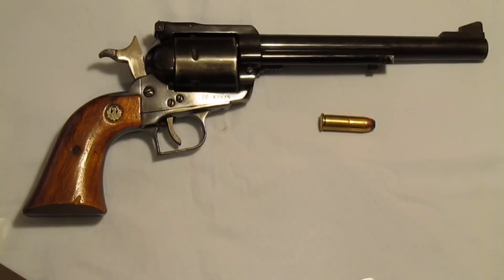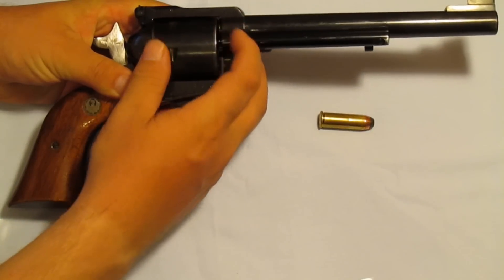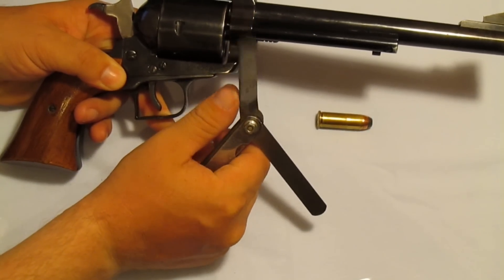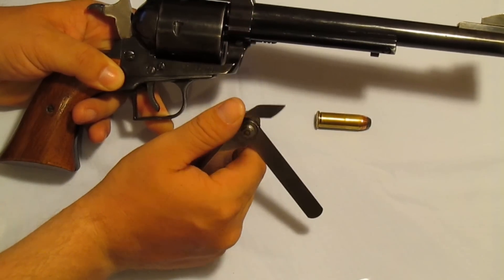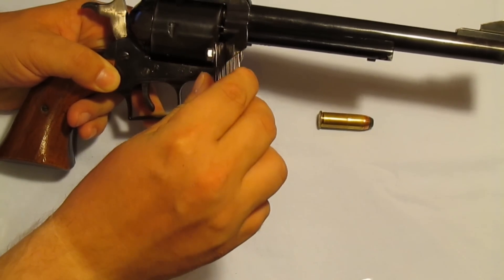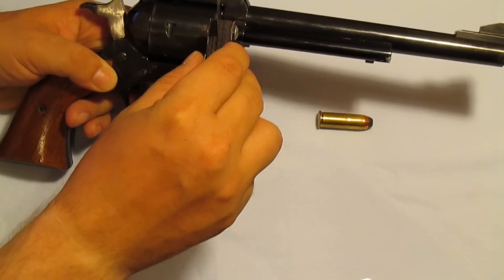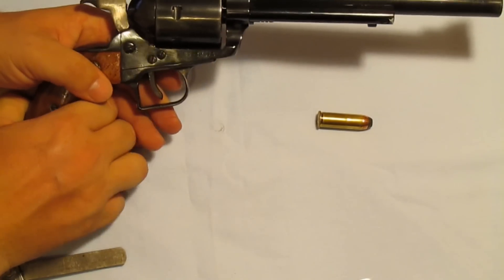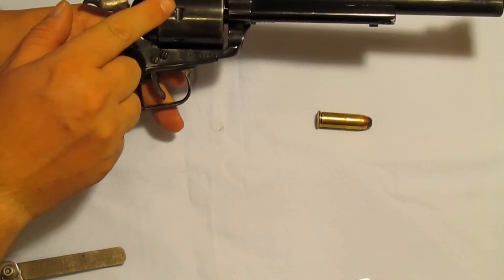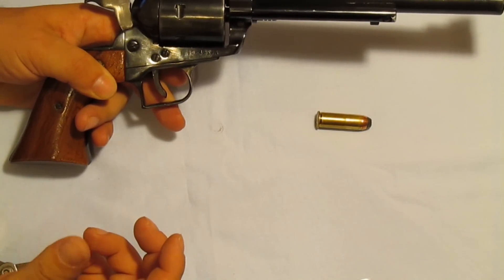The safety issue we're discussing is caused by the very small gap between the cylinder and the barrel. That gap is extremely small. This is a feeler gauge — this piece of metal is .05 millimeters thick, thinner than paper, probably as thin as tin foil, and it will just barely go through that gap. You can see it even sticks a little bit. When the gun is fired, the expanding gases from the gunpowder igniting cause an extremely high pressure gas jet to shoot through that gap at extreme velocities — higher velocities than even the bullet traveling.